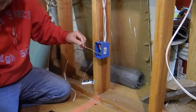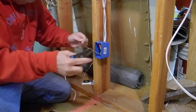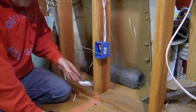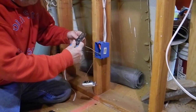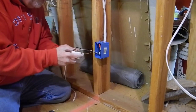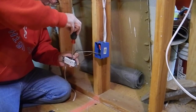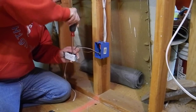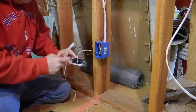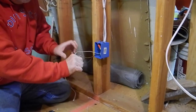Let's go do the neutral. The neutral's on the same side. Now if you do it backwards, it's not that great an idea, but since this is solid wire it's not the end of the world. But if you do that on braided wire, that would not be cool. Tighten that up. These things also have plug-ins which save time, but I wouldn't put those on my house.